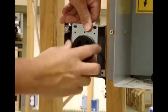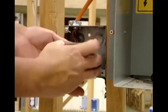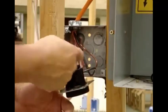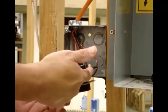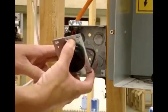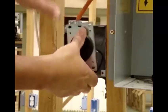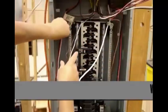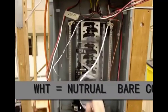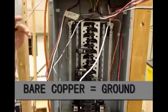Usually I have a plate here — screw it on and that's where it's going to be. Keep in mind you must tie your ground first, then get into the neutral, and then do the other things. Always shut your main panel box before you do any kind of work, and that will be a 220. What I like to do is trim my bare wires. Don't forget to wear your safety glasses — in case you get poked in the eye, you'll have your glasses there.